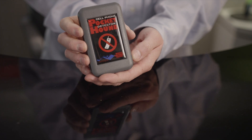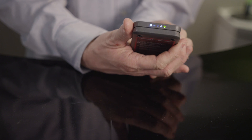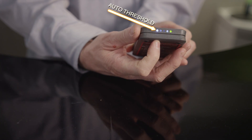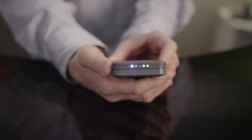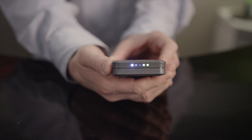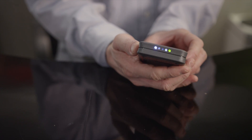The Pocket Hound ships from the factory set to Auto Threshold, but will remember the last setting the user has selected even after it is powered off. Push the button to show the threshold setting — the blue LED on the far left indicates Auto Threshold is currently active. In this setting, the Pocket Hound will measure the RF noise floor of the area and apply its own smart filtering so that cellular phones will only trigger the device and not other sources of RF energy and interference. Sometimes areas with a high concentration of metal or glass may introduce too much interference or shield cellular activity from the Pocket Hound receiver, so it might be necessary to switch to manual threshold in these cases.